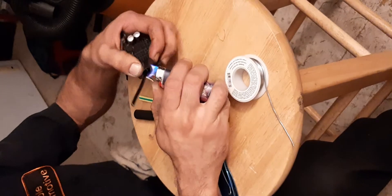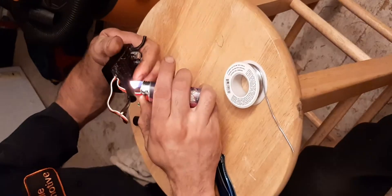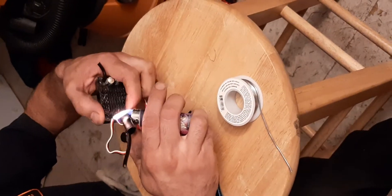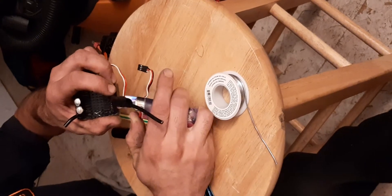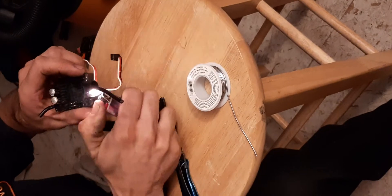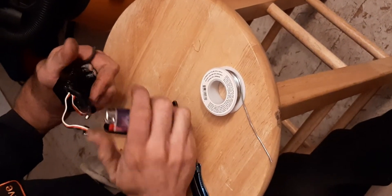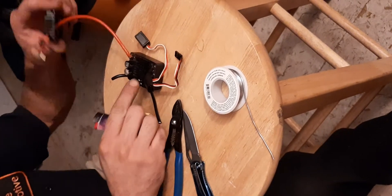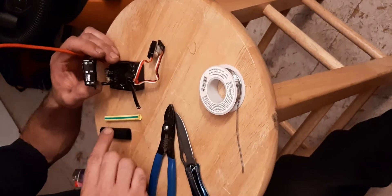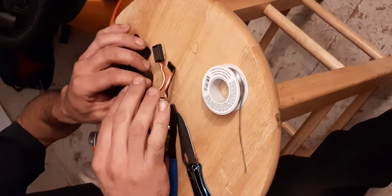For time's sake this isn't going to shrink down on one wire by itself because it's meant for all three. But basically you get them all set up like that, put your shrink tube over top, take your shrink tube and get it hot — melt all three of them together as tight as you possibly can, nice and close. That way when you start putting them through the cases of your motor or whatever you're trying to get through, you don't have a huge glob of wire. Once you get it all tightened down, that's pretty much what your repair is going to look like. I hope this answers anybody's question on repairing a motor or an ESC or something you've cut down short. I took the top right off of this ESC, pulled the fan right out of the way, took the plugs and everything right off so I could gain a little more length and spread the wires out to get all my solders evenly.